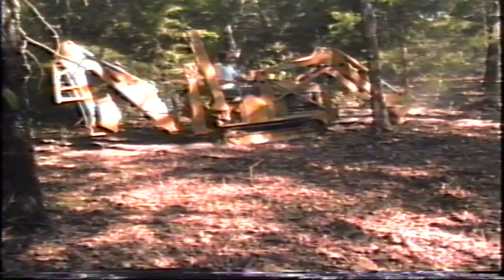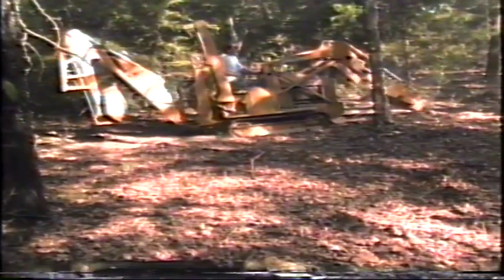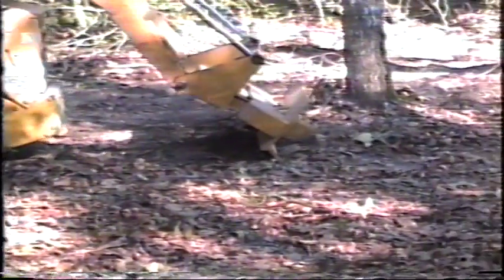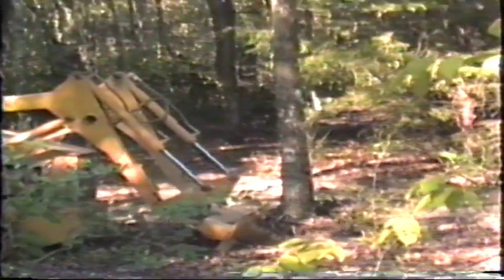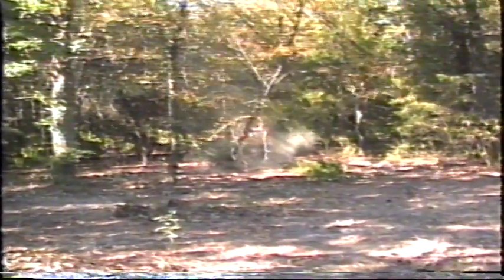Using the loader's lift and bucket hydraulics, he works his ripper up and down and forward and back, creating a cut path around the tree. This action cuts and tears all the side support roots as he makes his way completely around the tree. In an elapsed time of less than 12 minutes, he has done sufficient ripping to start the process of overturning the tree. Using the brute strength of his Magnatrac, he starts to push high on the tree to gain leverage and to start tearing and snapping the tree's underside roots which he couldn't reach earlier with his ripper.